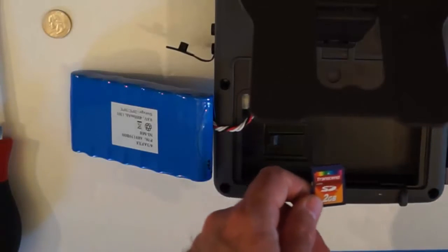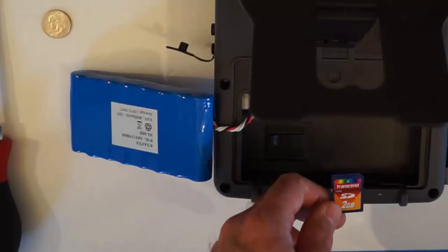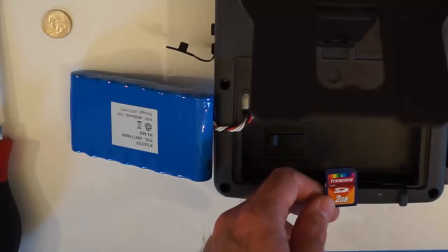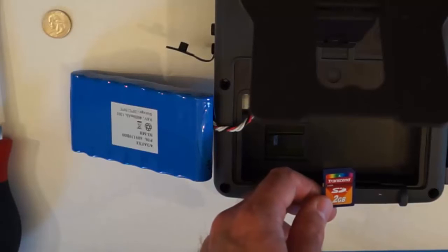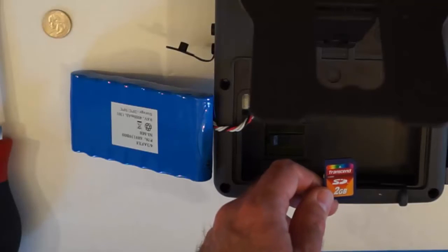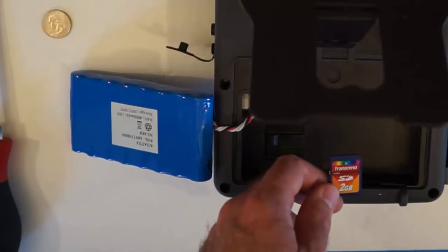Okay, so now the reason we do that is we don't want to lose our data on this card. We have 2 weeks recording. It might be hard to go back to the same location to record that. And if we format that on the Windows PC, we've lost the data. The formatting process overwrites certain blocks that will make it essentially impossible to recover the recording. Even though most of it is not overwritten, the critical parts are, so we don't want to do that.